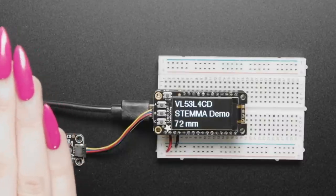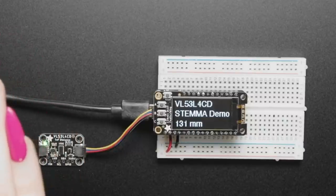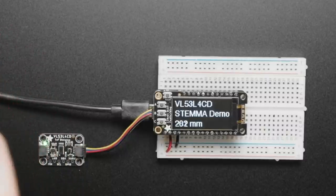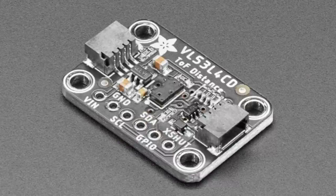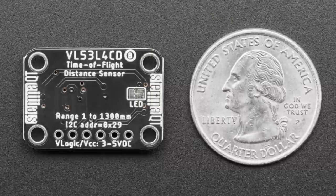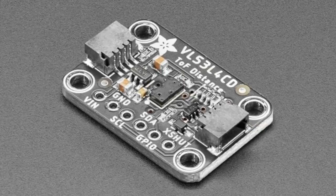According to the data sheet, it can do as little as 1 millimeter away. So it's good for closer measurements, because the other sensors can't do less than 1 inch, 1.5 inches away, and this one can do less than that. It's got Arduino library support right now. We'll be working on CircuitPython library support. So if the text description says it's got it by the time you watch this video, it does. As you know, this chip just came out and we got it real fast into the store using the Arduino library.